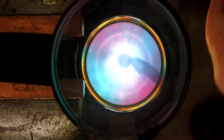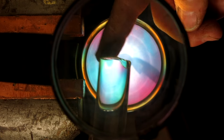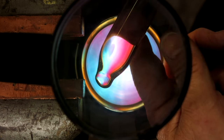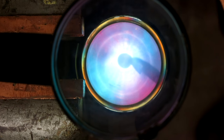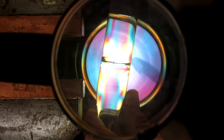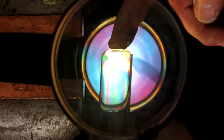Here's another one — this is not annealed. So there's the end and you can see the stress in that end there. And this has a little crack in it that's showing up as a stress concentration. Pretty cool, huh? I think there's an annealed piece in here — yes, this next one's annealed. It's been cooled very slowly. Even though the end is chipped there, there's really no stress — looks pretty clean. And here's another stressy piece — check that out. Let me put some load on that. And then the end here — pretty wild, huh?